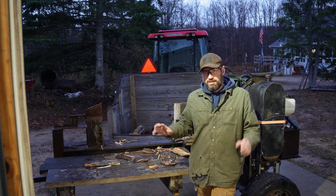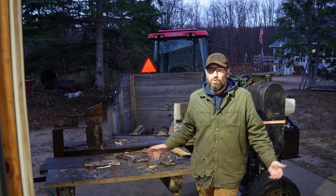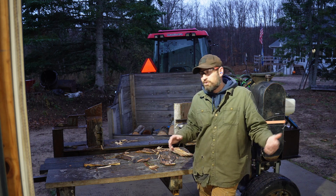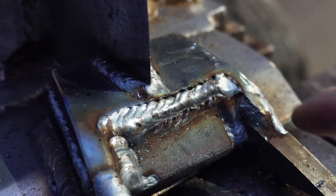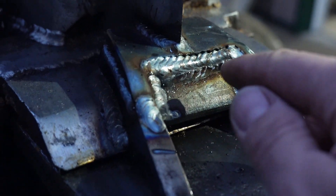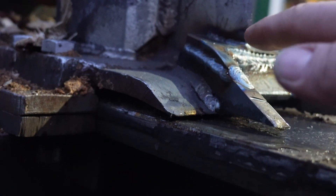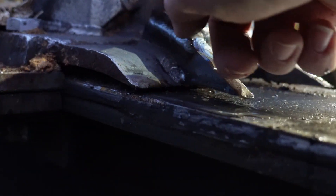So I had already done a full closeout — I was frustrated going to call it quits — but I got to thinking, you know what, I have almost 80 face cord to do, if not more. I don't want to be dealing with any stuck logs whatsoever. So the last couple hours I went ahead and fabbed up some more steel and put it all together. I just added all of that right here — these two little pieces and this piece in here. So hopefully now when the wood gets caught up here, it rides up the ramp, slides up that, and then is high enough that once the bottom of the wood is here, it's above the heads of those bolts.